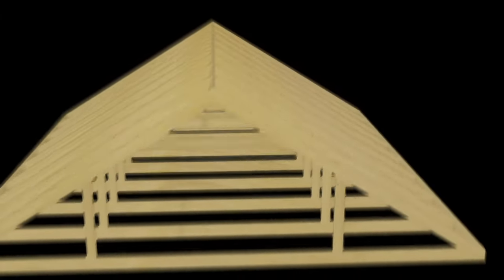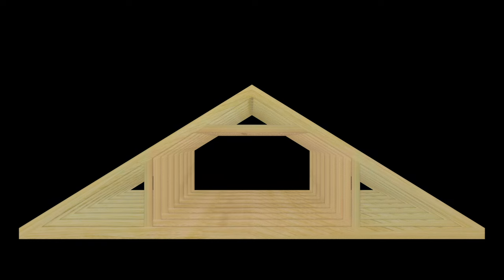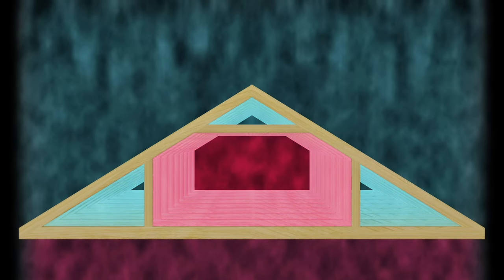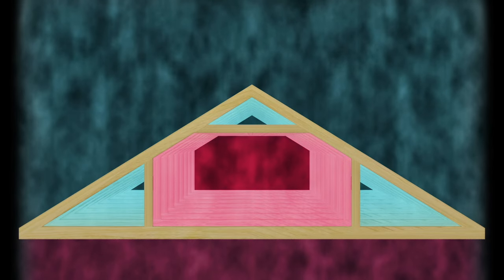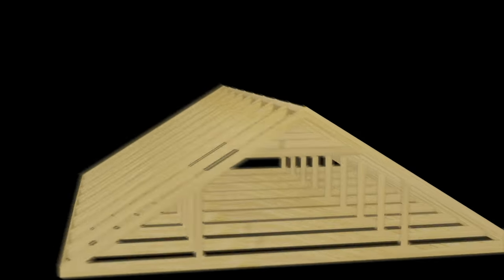So this is a model of our house roof. We've got the warm room-in-roof situation up there. So we've got two rooms, and then we've got the loft areas in the eaves, and they're just conventional loft storage space. So all that warm, moist air in the house has got to get out before it causes issues and before it condenses on the underside of our roof surface.